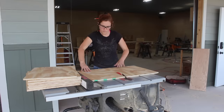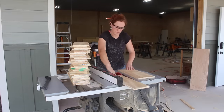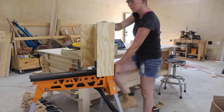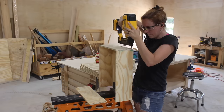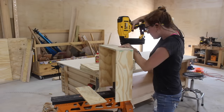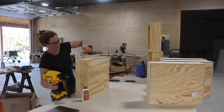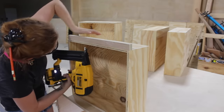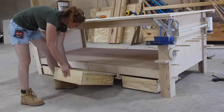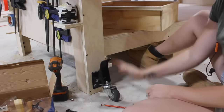After getting it on its side, I glued and screwed in all of the rails before moving on to making the drawers themselves. The drawers are made from half-inch plywood and it took an additional two sheets to make all of them. I kept my drawer construction very simple since I don't plan to overload these drawers — I don't like things being out of sight because then they're out of mind, but there are a few things that go well in drawers like shop rags or foam brushes. After building the drawers I attached a wooden rail to both sides, then used a little paste wax on the entire wooden railing system so everything moves nice and smoothly.